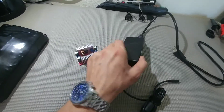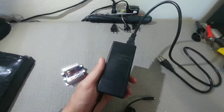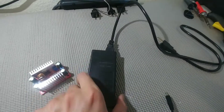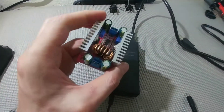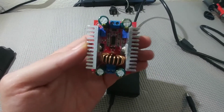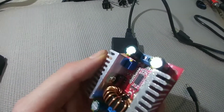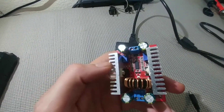The way we will do this — the first thing you'll need is a laptop charger. Everybody has one laying around. This one is just a generic laptop charger: 19 and a half volts and 4.62 amps, so it's a fairly powerful charger. And what this other component is, it's a step-up converter. What it does is basically boost the voltage and also lets you control how much current it sends out. You can boost the voltage all the way up to 60 volts. I'm going to go to about 41 volts to charge my battery to 4.1 volts per cell, and current-wise I should be able to set it for about 4 to 5 amps.